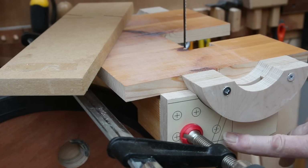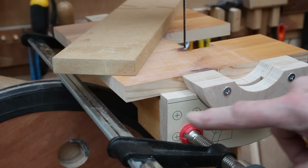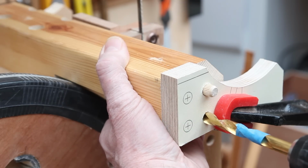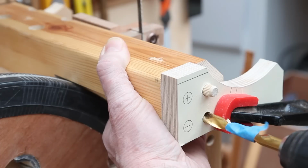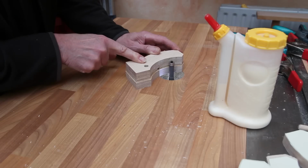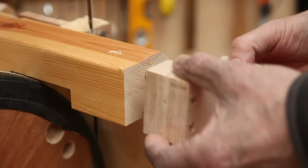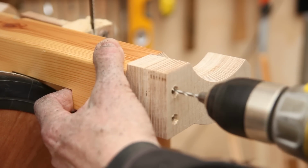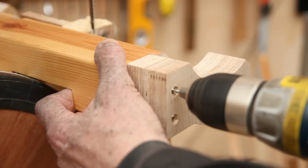So I decided to cut one 18mm outside piece as accurately as I could, cut the other two pieces out slightly oversized, glue it all up, and then use the flush trim router bit to trim the oversized two pieces to the accurate piece. As for attaching, I decided I'd use two dowels and three screws. I'd clamp the first accurately cut 18mm piece to the trunnion support beam, and I would drill right the way through that piece into the beam for the first two dowels, and then they'd become blind holes when the other two pieces were glued up and trimmed. And after gluing up and trimming, I would then drill through for the three final securing screws. So here goes the pilot hole.